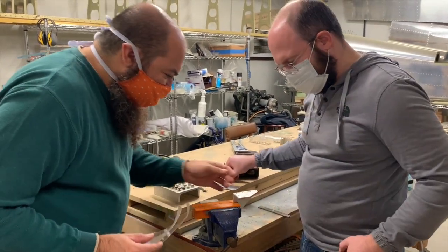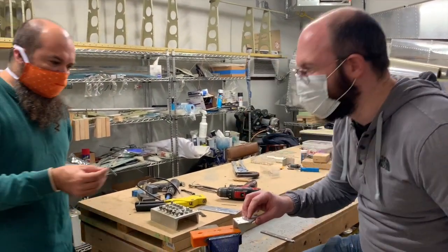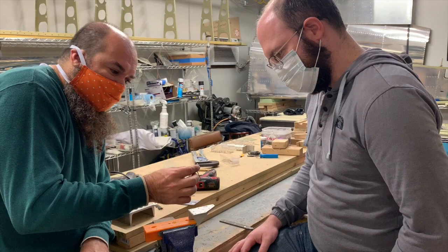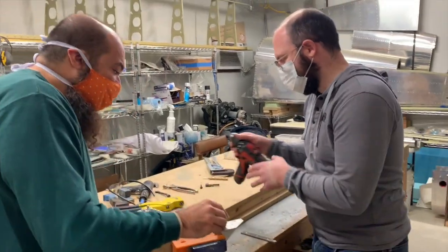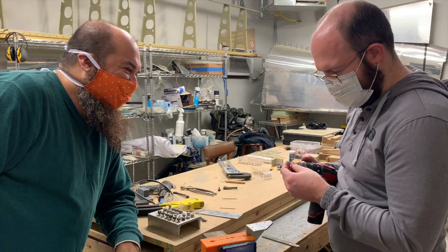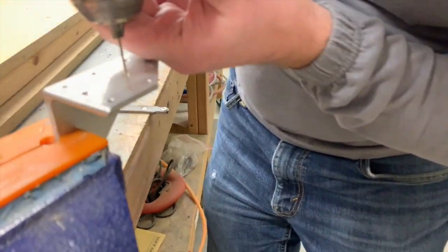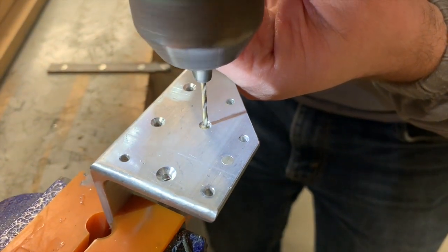Now what do you do with the rest of this? You've got a couple of different choices. I would take a smaller drill bit — a 1/16th — and get it just past the bottom of the countersink. You don't want to touch the metal. Because this drill bit is smaller than the size of the hole, you've got a better chance you're not going to touch the metal. Then we can use the punch to punch the rivet through. There's not going to be any head on the side anymore — it's just friction at this point. You've squeezed the rivet and expanded it, so there's a lot of friction.